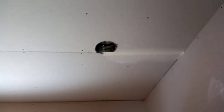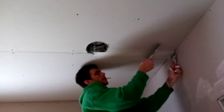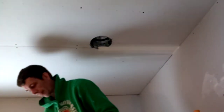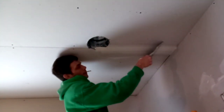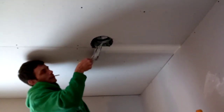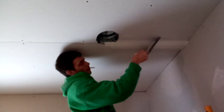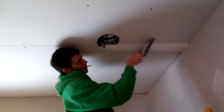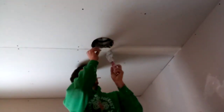It's very important to make sure also, Dave, that you get your tape, that seam in it, and the seam that you're filling. If you don't, it'll offset the mud. That's why you use a wider knife like this. And the reason why you also do this with a wider knife is that it's less sanding you have to do at the end, because you get it nice and clean. I see how you got it all nice and clean on the edges there.